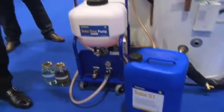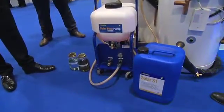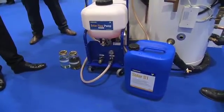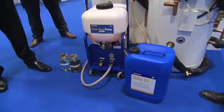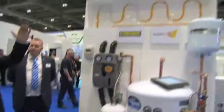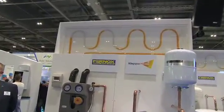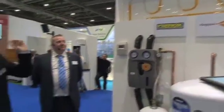Also in there you've got thermal stabilisers. The thermal stabilisers provide stability up to 360 degrees for when the panel remains still and there's no flow happening. The sun is always bearing down on the panel, heat is always being transferred, and if there's no flow within the panel — say there's no demand or the panel hasn't been spec'd right — it will remain stagnant, and the glycol within it will burn.